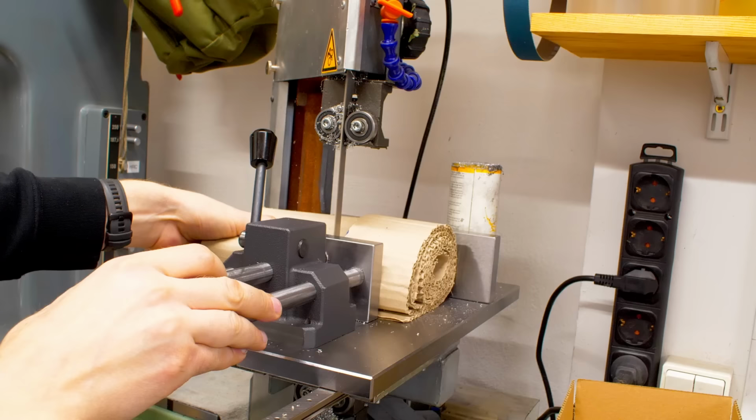Welcome back. A customer requested me to make him a bunch of carbide bushings. Means solid carbide, means different set of challenges in machining than regular steels, because normal tools don't cut it here. Literally. So what I need to do is make bushings like this, about 10 millimeters long, 8 millimeter OD, and various sizes of bores on the ID. And they also need a radius ground or machined onto the entry of the bore on one side.